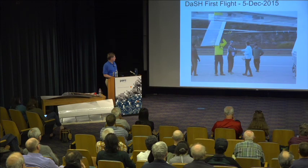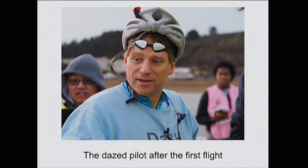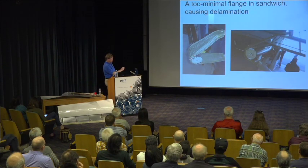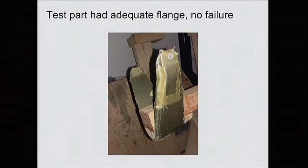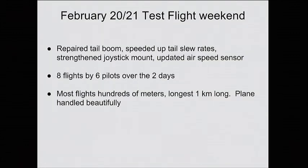I had about two hours of sleep the night before, so when I put my helmet back on I put it on backwards. I was just amazed at how successful the first flight went. We had that problem with the breakage — it turned out the flange got cut back a millimeter or two short, and that's the high-stress part of the piece. You can see how it separated and delaminated. So we went ahead and did a test piece with just a couple more millimeters of material, did the cartop testing you may have seen in the video playing when you walked in, and that was enough to make the difference. We went overboard — got carbon fiber, put a strut in and big flanges, and that's worked just fine ever since, adding just a few hundred grams.